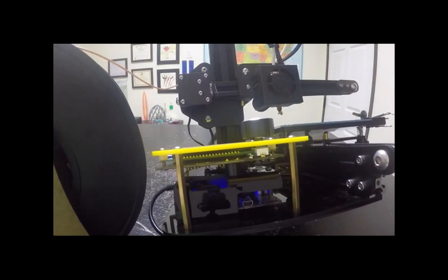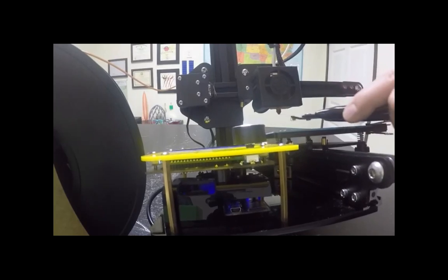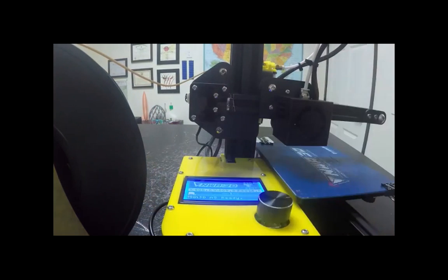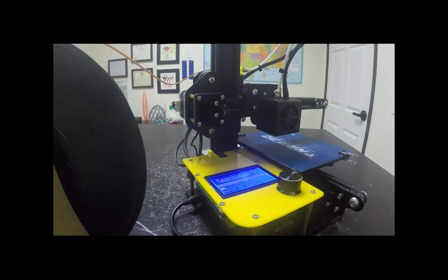And then you can reach in with the tweezers or the pliers or your tools to grab the filament off, so you're not reaching in with your fingers to get burned. And then you can pull it off. The filament cools right away, but the nozzle is about 500 degrees Fahrenheit, so it's really hot. Because everything on here is Celsius, so it's 220 Celsius. Okay. Got it? Sweet. Okay, so go ahead and unplug it.